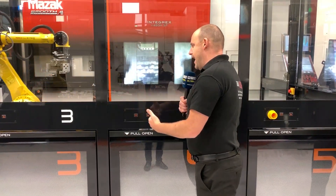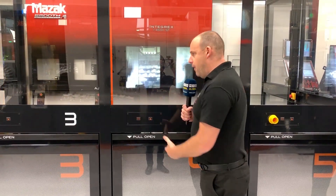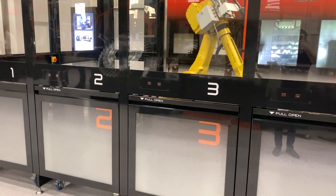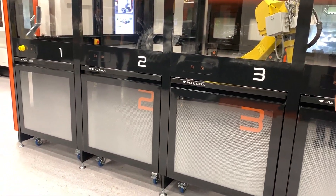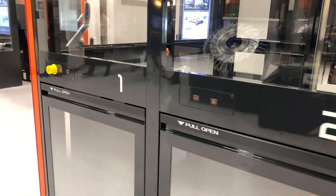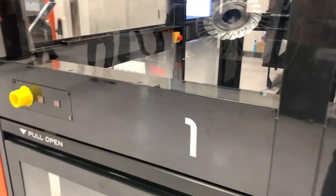The pallet systems we have here — we've actually got five stacking areas, two of which are for the components and the other three are for things like tools, accessories for the machine, and you could include metrology in this as well. Of course, you program the robot to do whatever operation you desire at whatever time the requirement is met.